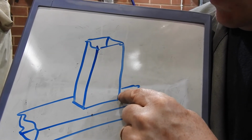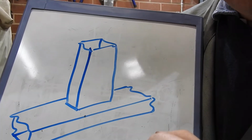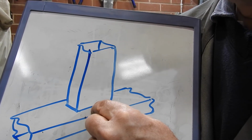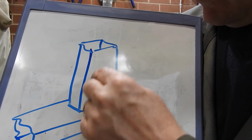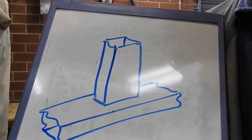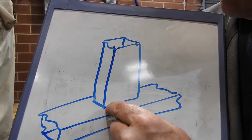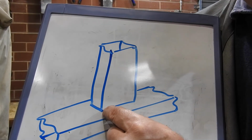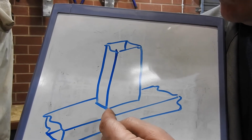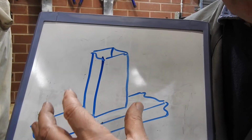Okay, so when you're starting here, everything's cold. The heat is really going to rocket out of there. Once you're halfway along, you can probably assume it's pretty much a steady state condition, that the heat is going out in the various directions in a relatively standard way. When you get to the end here, everything's heated up, and you then have the problem that you need to back your heat off because everything's already hot. There's nowhere else for the heat to go. It's going to build up and it's going to melt.